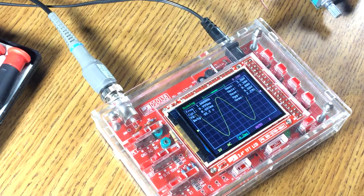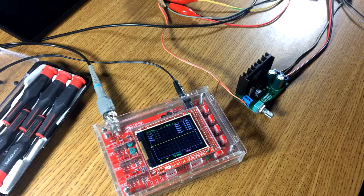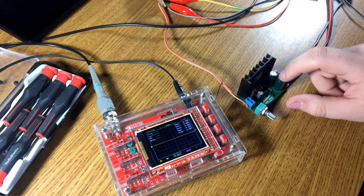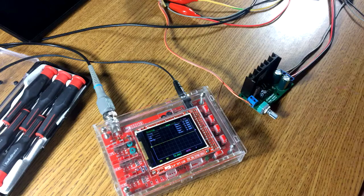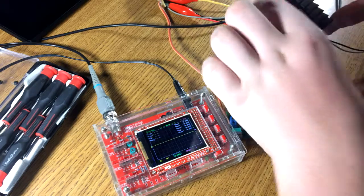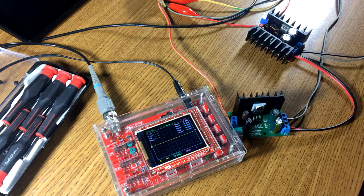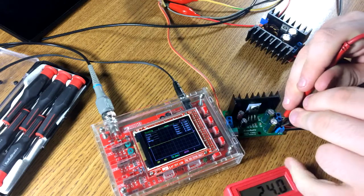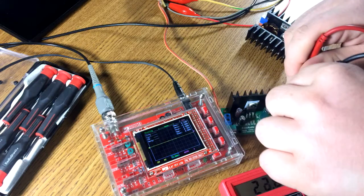I'm going to cut the camera and test 4 and 8 ohms at a wide variety of voltages, measured at the amp board. Remember when I said my power supply doesn't go past 21 volts? I thought of a way to test this at 35 volts, which is the max rating of the capacitors. By the way, there is no reverse polarity protection, so be careful. The solution to getting higher voltage is a DC-to-DC boost converter. These are going to be running at higher voltages so I'll be recording the whole time — if it explodes, it'll be on video. It hasn't blown up and it's set to 24 volts right now. Voltages are taken from the amp board.